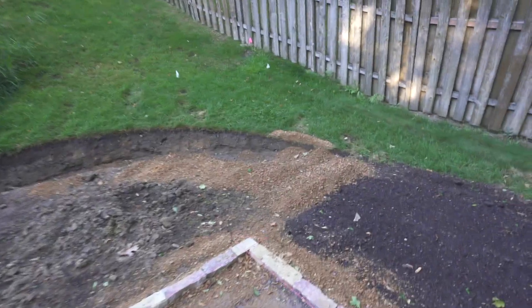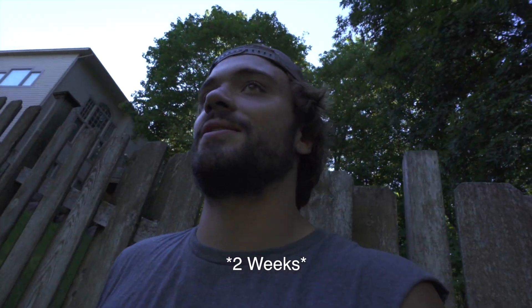As you guys have seen, we have been doing base for a very long time — approximately two weeks. We are finally on our final layer of crushed granite, about three to four inches of it. Also working on this boulder wall. I'm thinking 12 to 16 inch field boulders for that. Bobby and Brian went through and piped out the whole thing today to make it perfectly level. Arnie and I knocked out the boulder wall — they wanted something to tie in this hill. It looks great. It's been a solid day and we'll get back after it tomorrow.